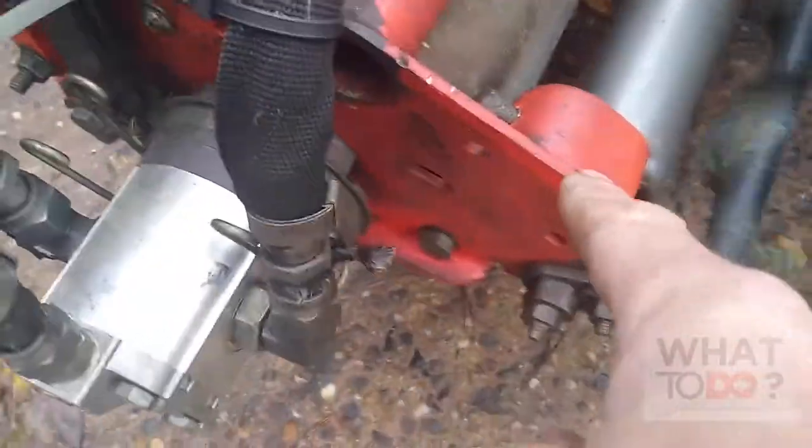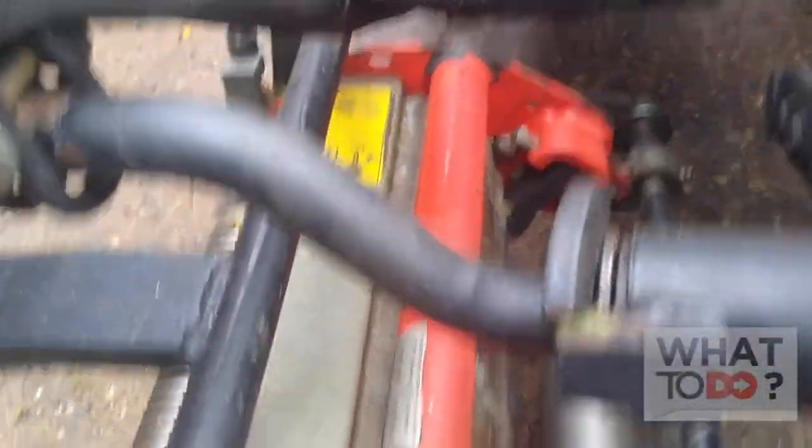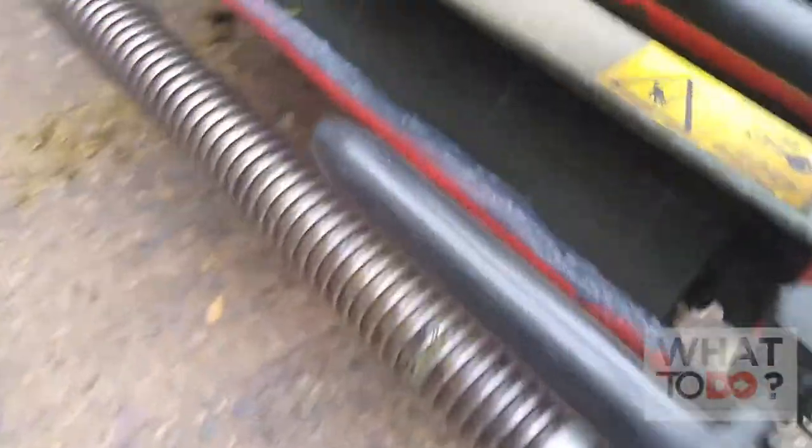No contact means we're going to have to shut the machine off and come back to adjust these on each side. That reel is not making any contact at all. You can leave the machine on and adjust until you hear contact as the reel is spinning, or you can adjust while it's off and then turn the machine back on to check if it's too tight or too loose.